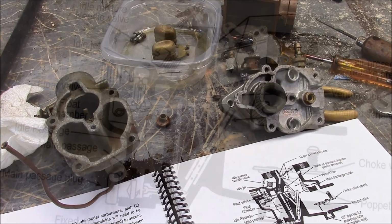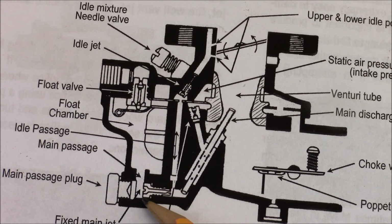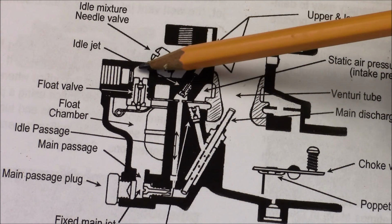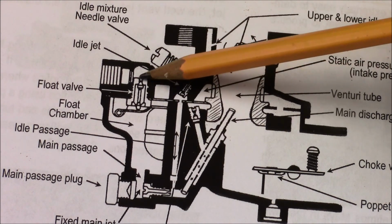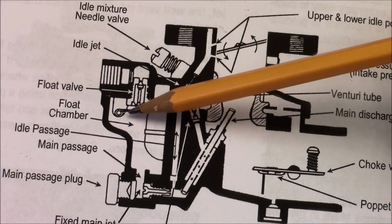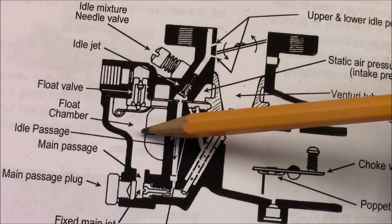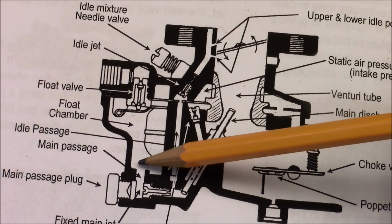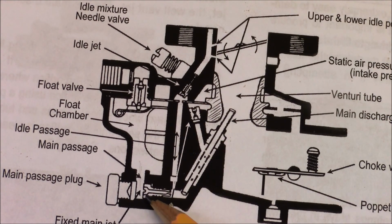Let me show you what I suspect happened. My theory is that some dirt got caught in this fixed main jet. What happens is the gasoline comes in through this float valve right here, controlled by this float. And so this chamber right here is filled with gas. Then all the gas to run the engine goes through this, what's called the main passage right here. Then it goes through this fixed main jet right here, and it's a real tiny hole,